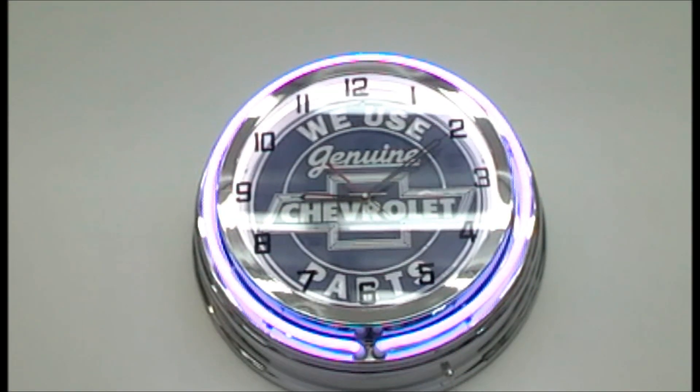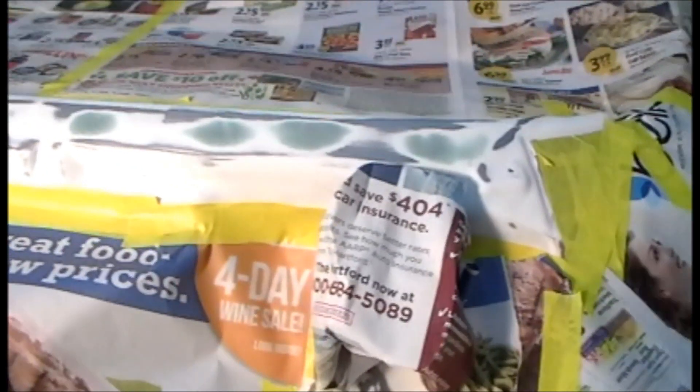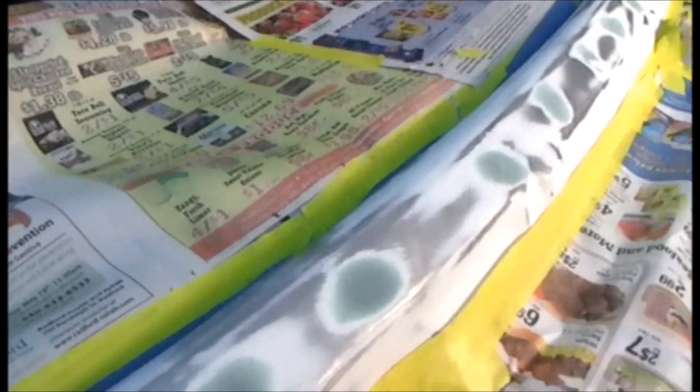Okay guys, it's May 2nd, late in the evening, Saturday night — right at 10 after 9. Just a quick look at the deck filler panel after I put the fiberglass filler over those low spots. This is all in 80 grit, and then the rest of the areas are scuffed with a scotch bright. I'm getting ready to put two coats of white epoxy over all of that and let it sit overnight.